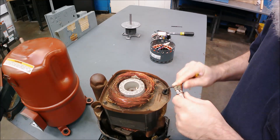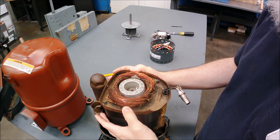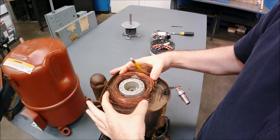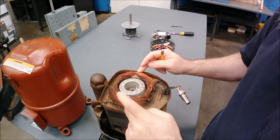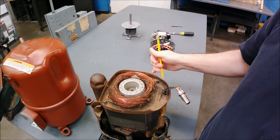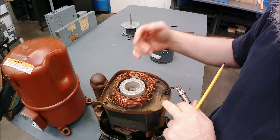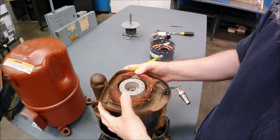Now the windings themselves — this is what we're talking about when you see motor poles. One, two, three, four, five, six — it's always an even number. You're never going to have just a one-pole motor. What we have are the run and the start windings here. When you hear about motor poles, the easiest way I think about it is pretty much for the run winding. We can look up the specs on this old motor and it will tell you, since it's a fixed-speed motor, that it has around 3,500 RPMs, and that's indicative of a two-pole induction motor.